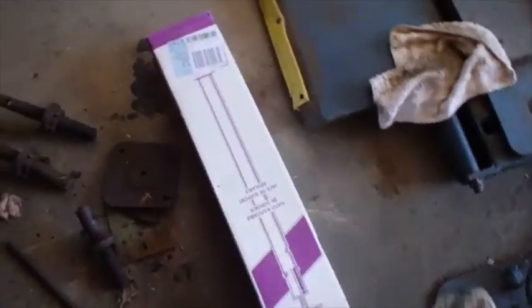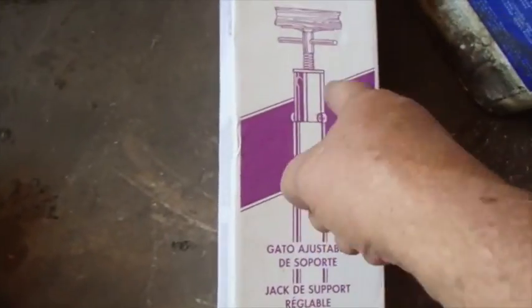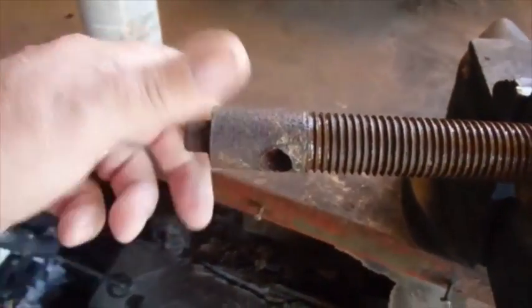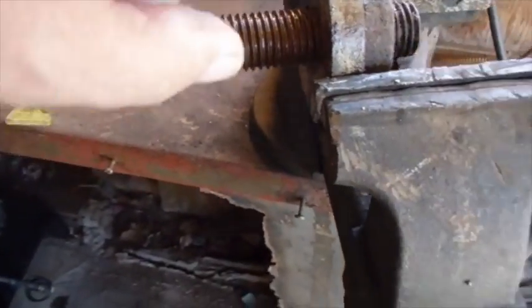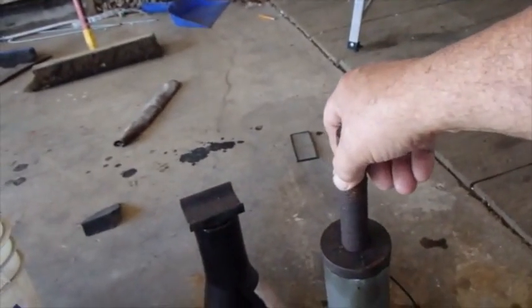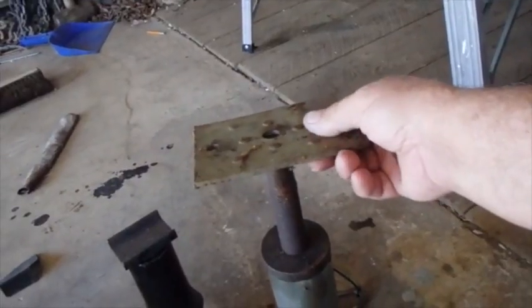What I also have is this — it's in the box, I didn't use this one, but you can see a picture of it. This is like a house support jack, and it has a little screw mechanism that sits on the top of it. The screw mechanism looks a lot like this — actually, this is one of them. This piece screws up and down. This round piece fits into a piece of pipe, and then there's a little piece that goes on the top of that to go up against the floor.